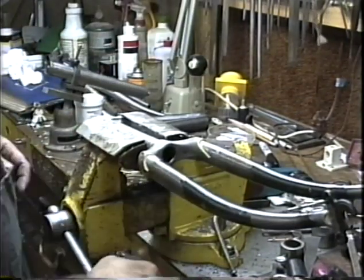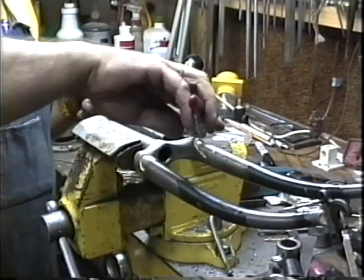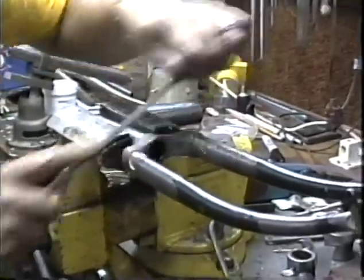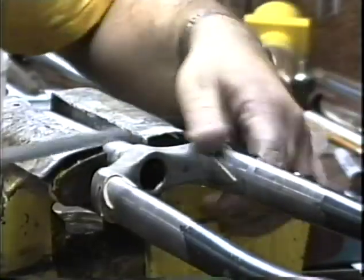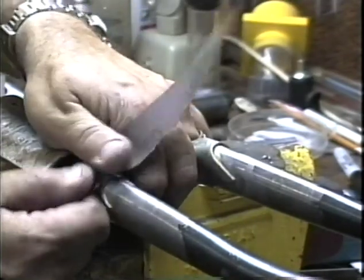We've got those pins sticking up. We need to get rid of those. Most of them, about 3/4 of them, can be just clipped off. And we can get that last little quarter. Obviously, we don't worry about the part of the pin that's sticking on the inside of the fork. And do a final sanding with some emery cloth strip.